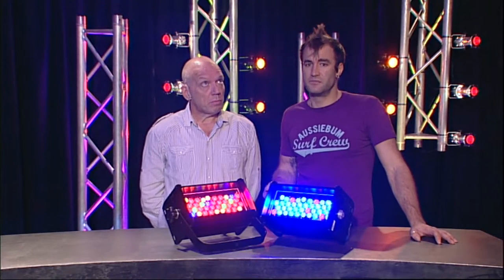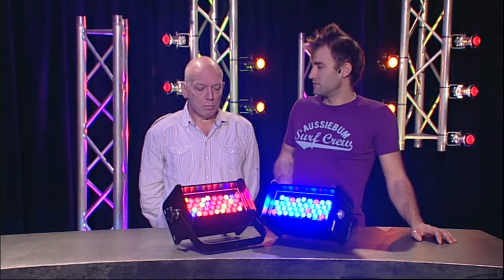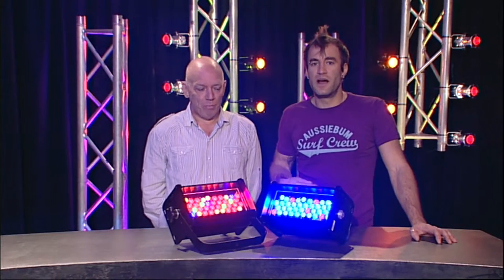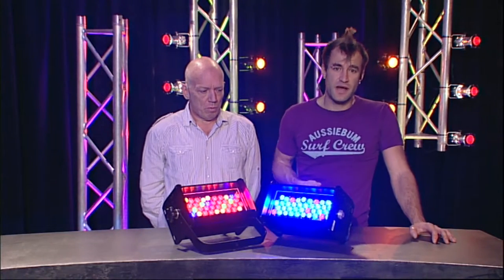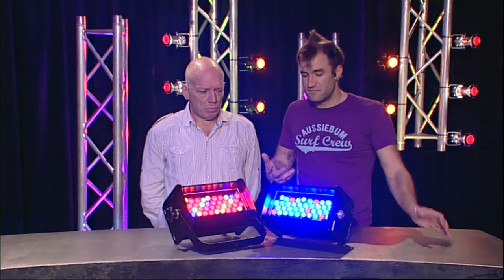If you look at something like Congo Blue which is about 3% transmission — running full tilt with those in par 64s, you get maybe a couple of hours. Then you pull them out, throw them away and replace them — for which you've also got to pay someone to go climb through a rig. So there are some safety savings to be had as well.